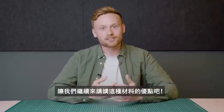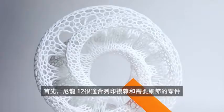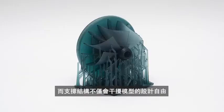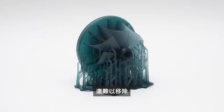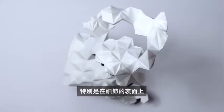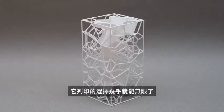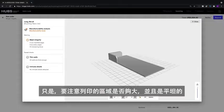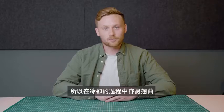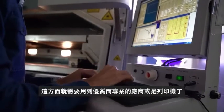Let's move on to the benefits of this material. First, it's good for printing complex and detailed parts. This is mainly because there are no support structures needed during SLS printing. Support structures interfere with design freedom and are hard to remove, especially on small detailed surfaces. For Nylon 12, as long as the minimum wall thickness of 0.8 millimeters is met, your options are virtually limitless. Just be wary of large flat areas, as the parts are printed at high temperatures and are prone to warping during the cooling process. Our production partners are experts and will apply a slow, natural cooling process to your parts if they require it.